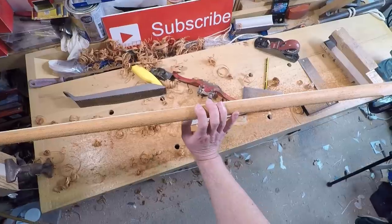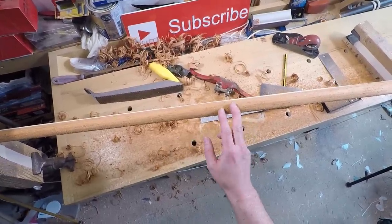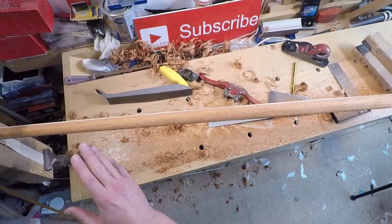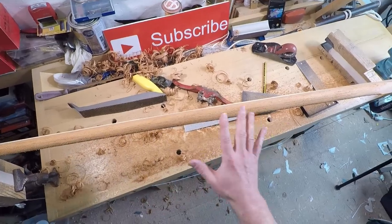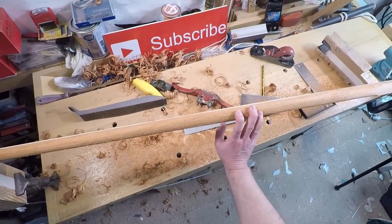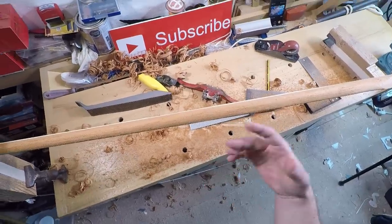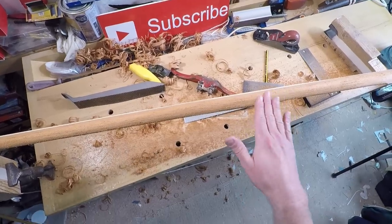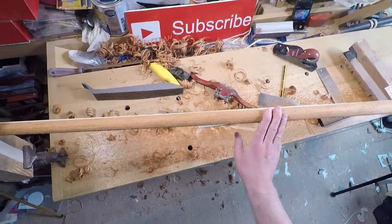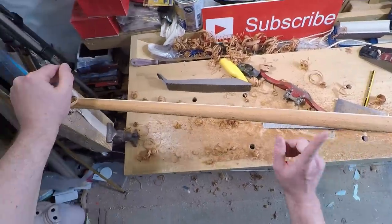It's a very difficult thing to do, particularly if you haven't got experience in working with bows. But building up a mental picture of what work you've done and what you're about to do is very important when working on a bow. You don't want to end up with one area that you keep working on, then doing the rest of the bow and forgetting that you've already been on that area and end up, as I say, with an artificial dip, an area that didn't need to be a problem. Okay, that's just something to bear in mind.